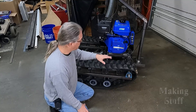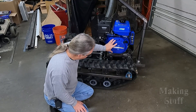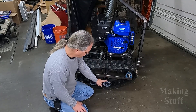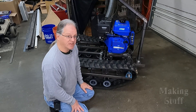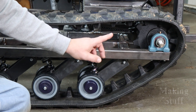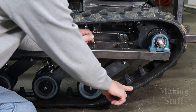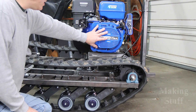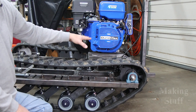Here is the reason why this thing wants to nosedive. Here's the engine and here is the front bogey wheel, and pretty much most of the engine sits in front of this bogey wheel. So if you think of this as a car and this was the front wheel, your engine would pretty much be mounted on the bumper — no wonder this thing wants to nosedive so easily. One option is to move these bogey wheels forward so they support more of the front weight. I could even squeeze another one in right here to help support some of the weight of the nose. Another option would be to move this motor back. I think in combination, moving the motor back and moving the bogey wheels forward will help balance the machine out quite well.